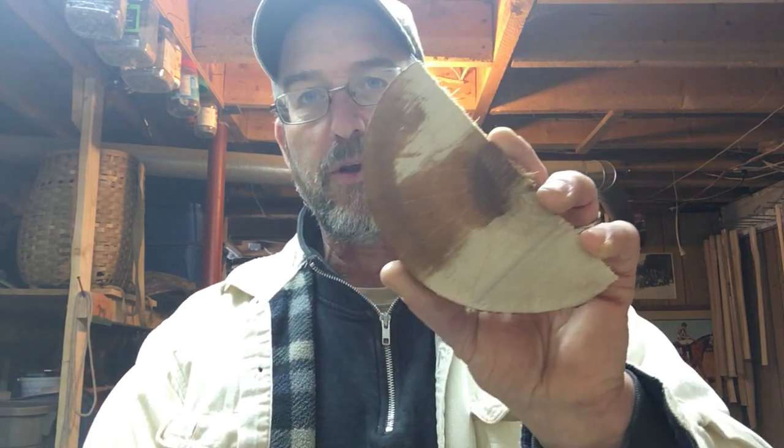I've got a couple of pieces of wood here and I'm going to use some boiled linseed oil. If you want to treat a handle, boiled linseed oil is probably one of the best things to use on it. It seals the moisture out and keeps it roughly at the same moisture content in the handle, because moisture is what causes you problems in your handles.